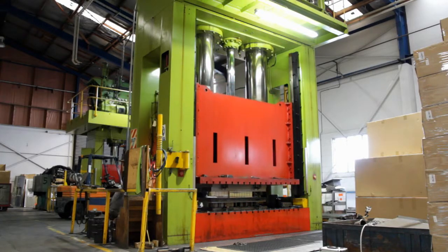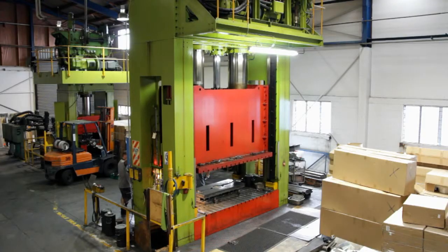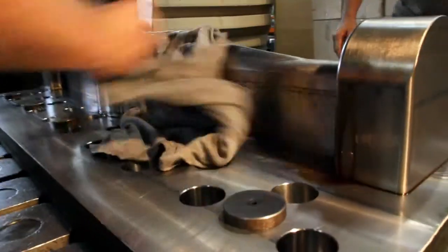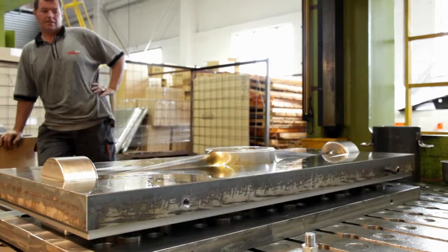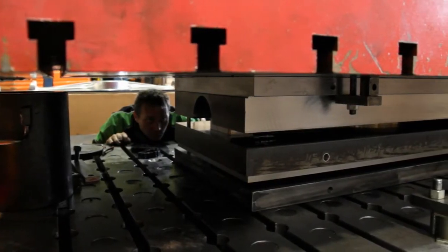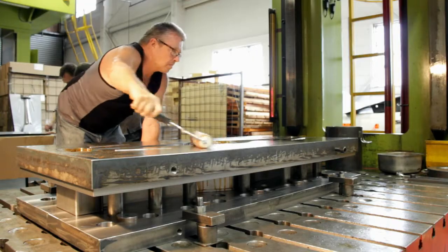A new baby called the Chung Mao — it's a thousand ton hydraulic press with a 2.7 meter by 1.7 meter working bed. It's got a 1.5 meter stroke and a hydraulic die cushion underneath with 50 to 750 ton variable pressure. With the hydraulic cushion we can actually produce tools cheaper for our overseas customers because we don't need to put in gas springs — they're already built into the press.